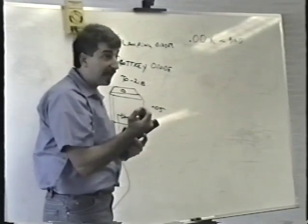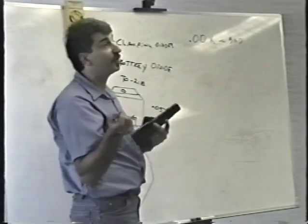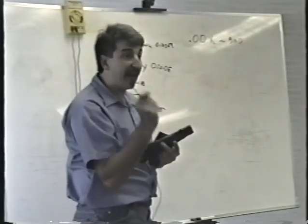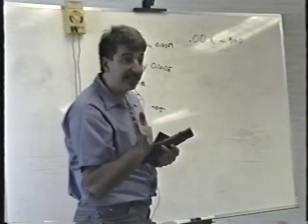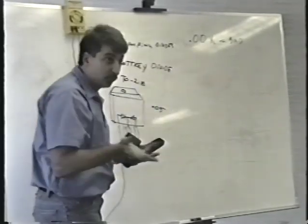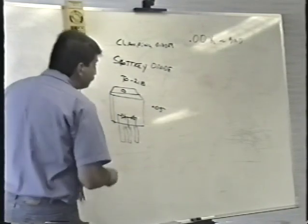Like the two diodes that I gave you, they physically look like they would work okay, and their specifications are even okay voltage and current wise. But they can't respond to the real fast switching action of the power supply. You need to get special high-speed diodes for these things. I believe Worldwide Component Distributors has these diodes.